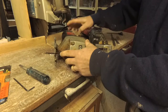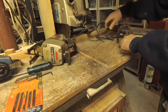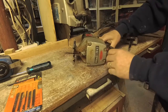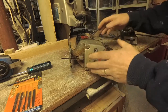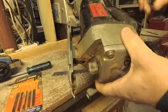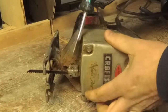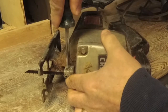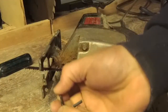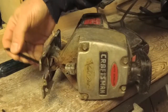Let's get right to it. If the blade is dull and you need to change it out, how do you do it in a scroll saw? I'm a little bummed — I just shot this entire video but I only got the first little bit of it. Somehow I clicked the button and shut the thing off. So as far as a scroll saw, to change the blade, they're all pretty much about the same. There's a couple of screws you need to deal with. This happens to be an older Craftsman Auto Scroller. You have the set screw on the side that goes into the hole on the side of the blade itself, and this set screw on the front, which is an Allen screw that pushes the blade back into its proper position.